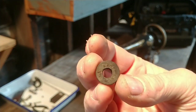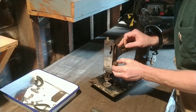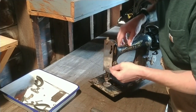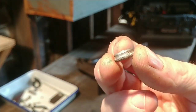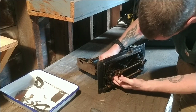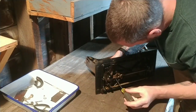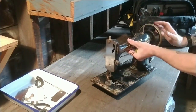The beehive spring is way too loose — it does not seem stiff enough at all, it's malformed, it's really gotten gacked. And that's that weird little rubber washer — that is not even a real sewing machine part. This whole assembly looked like it was just hacked together by someone to just keep the machine running. I'm checking the play on my little homemade check spring, just making sure that it goes up the same amount as the take-up lever. I'm not going to include that washer in the build — I think it was just pulled off something else and put there as a spacer.